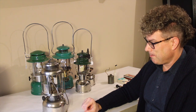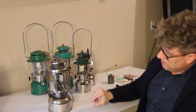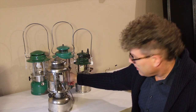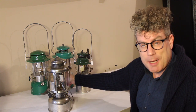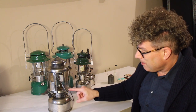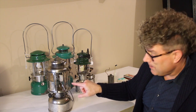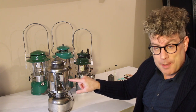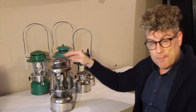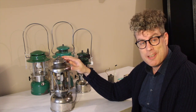So how do we deal with this? All of these require preheating. On the kerosene models, all of them have a spirit cup sitting at the bottom of the generator — you fill that with alcohol and it's used for preheating. The 327 is match lighting and you preheat this loop with a match. We'll get to that later. But first — and we've covered some of this in the previous video — I'll cover it again for kerosene lanterns in case you're starting here.